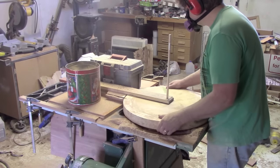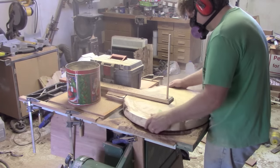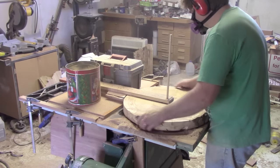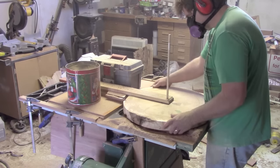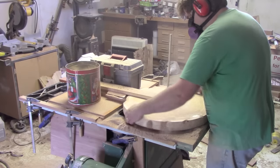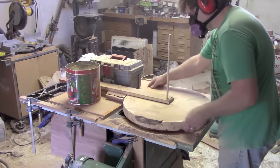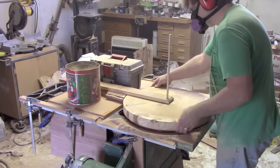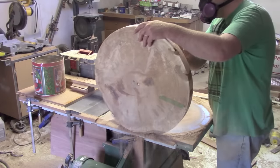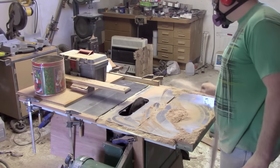And that's what we did — reset the jig and went right back to work. It wasn't as if this big hunk of wood was going to come flying out and kill people; it's too heavy. Maybe with a five-horse table saw or a direct-drive table saw, but I've only got one belt, and I know that mine will slip when it jams — and you can hear the belt screaming there. My fingers were never in a position where it could get me. My problem was I was hanging on to a piece of wood and I could tell it had gone wrong, but I wasn't entirely sure what to do. What I tried was wiggling it back and forth to make some room so I could hold it with one hand, and it didn't work. Because I was working from the end, I couldn't knee-kick the on/off switch. I think a few simple preparations would have prevented it from happening in the first place, and overall it's probably a lot more exciting looking than it actually was.